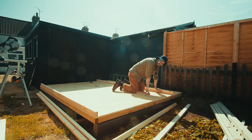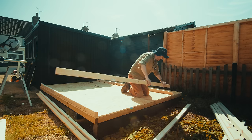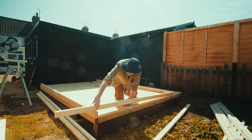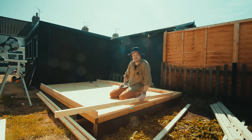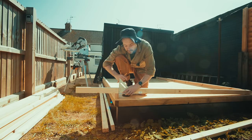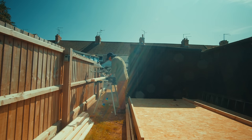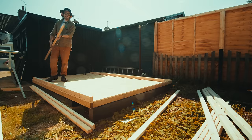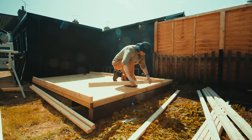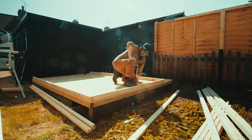I've got my top and bottom pieces, only cutting to length because it's three meters — that's the width of the workshop. Now I've got the angle I can get them in and work out the lengths I need for the front and the back. I need two of each cut because the front and back are going to be exactly the same. I've been waiting weeks to start this project because it's rained every day, and now today it's almost too hot — never happy. I nearly forgot to change the angle of the saw back to 90 degrees — oh, that could have been a mistake.